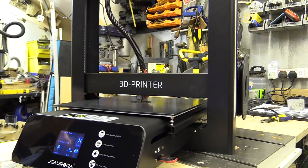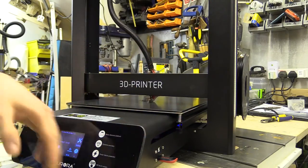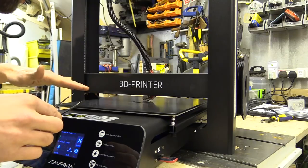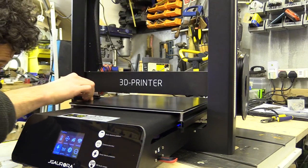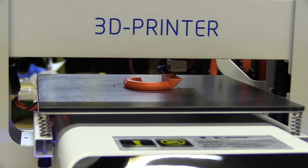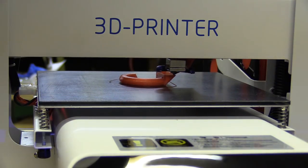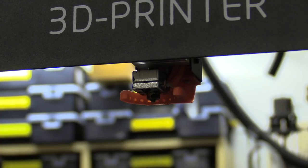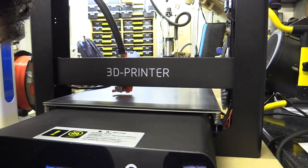The extruders look great, but the problem is it's lifting up as it's extruding. It still isn't printing well — it's literally printing all over itself, hopping or lifting between layers a little bit too high. I eventually gave up and printed a nozzle upgrade on the A3S which improved things a little. Obviously if you only have one printer you're probably going to lose your nut trying to print a new fan nozzle on a bed that doesn't stick. Part of the problem was also software-related — too much filament seemed to ooze out at first and curl up sticking to the nozzle. I'll write the start code and end code in the description below.